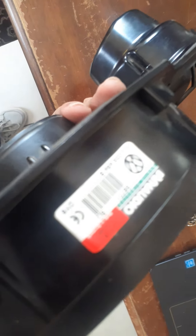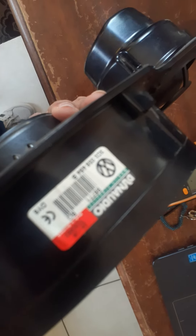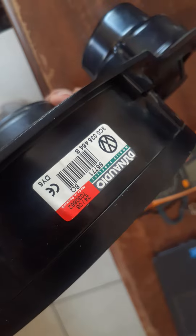The first thing you can do is just look around the speaker and you'll find this little tag here. You can see the speaker's ohm rating is eight ohms. If you can find that, it's going to be helpful.